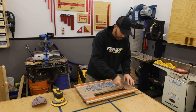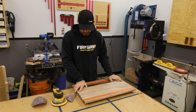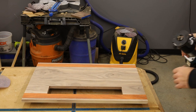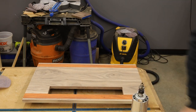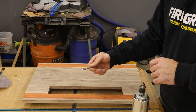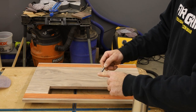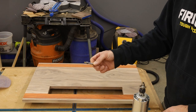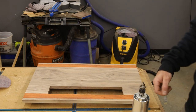I hate sanding, especially hand sanding — not my favorite, but it's got to be done. Oh look, I have a whole other side I haven't touched yet — great, go back to 100 and get it flat. I also want to put a very small roundover on all of this. I'm going to switch to a small roundover bit — it's a Whiteside 1980 from Bits and Bits, and they put their astro coating on there so it'll last longer and you can run it a little faster. It also has a brass bushing so you can get in tight corners. I just want a very small roundover — basically just break the edge over, it's like a 3/32nd. I'll run this around the whole piece and get it ready for final sanding.